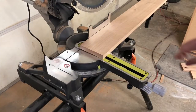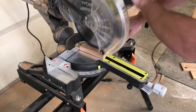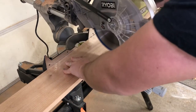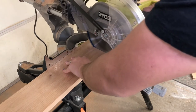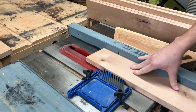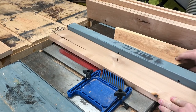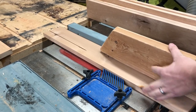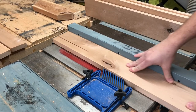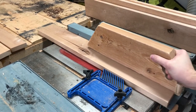So next I cut the lumber I needed for the desktop itself. So after cutting the length on every piece, I need to make sure I finalize the width of each piece. So I was doing about 3 inches on every single piece. The tabletop I left a little longer just because I didn't want to waste any wood, and it didn't really matter as long as the desktop had the same width that I needed.